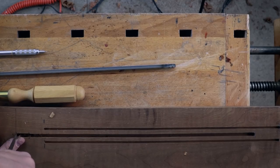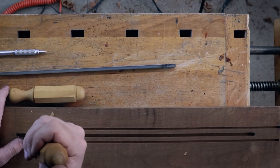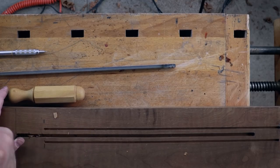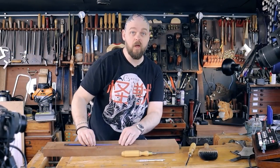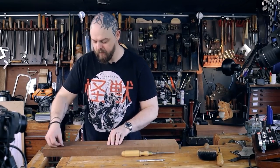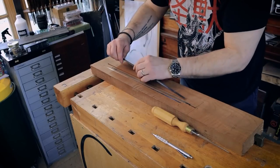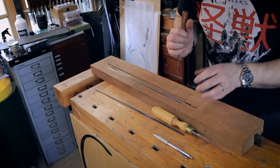Now, torrified sycamore and torrified maple is great to work, cuts easily, smells delicious and all that. It also does chip more than other timbers, so you need to be aware when you're routing that you could have some issues. Yeah, that one, a little bit longer.